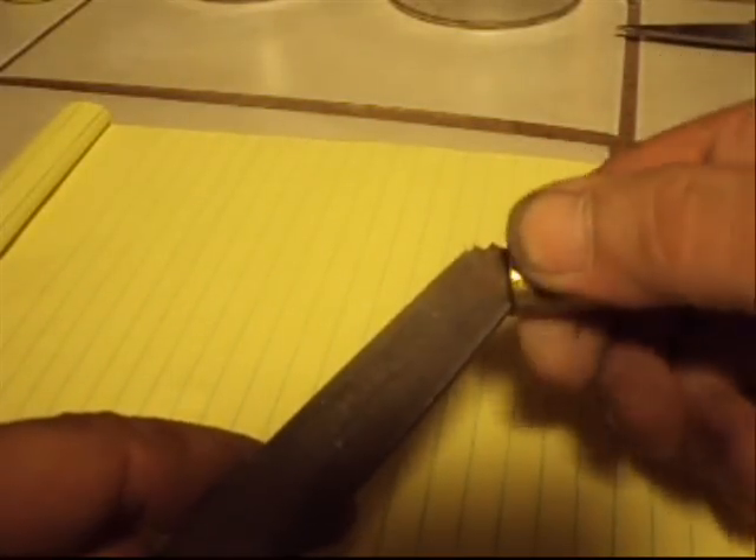There's a sharp edge on the edge. I'm going to get the stuff from the inside — I want to drag the back edge over here; that will turn all this out. Then just go like this on the paper — notice it'll look like lead, like you're writing. You'll see some lines on the paper in a minute; the paper wears it down and gives it a nice fine polished edge.